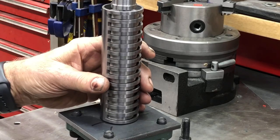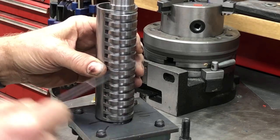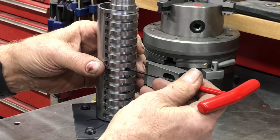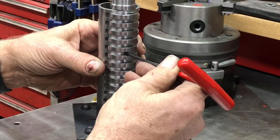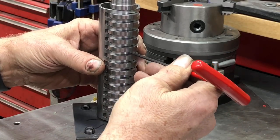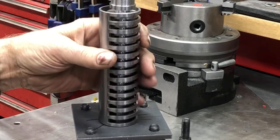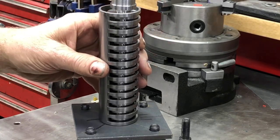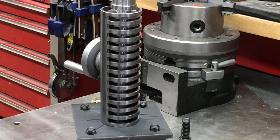And also, over here, it's got about 6 millimeters, you know, reliably 4.8 to 5 depth. So if something goes in here between the teeth, it's not gonna go any farther than 5 millimeters. When the teeth come around, it'll cut it. So the question is, how do I make this articulate at the same time that there's a spinning shaft in the middle with very sharp, hardened teeth on it? So here's the thing. I'm going to eyeball this. See, I'm going to bring it down a hair.